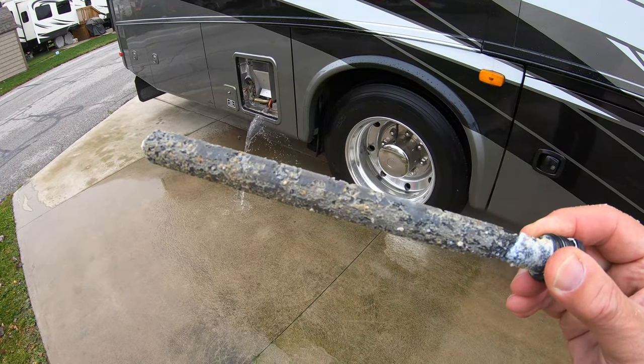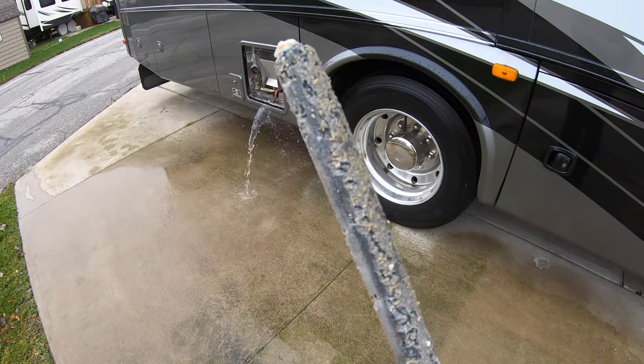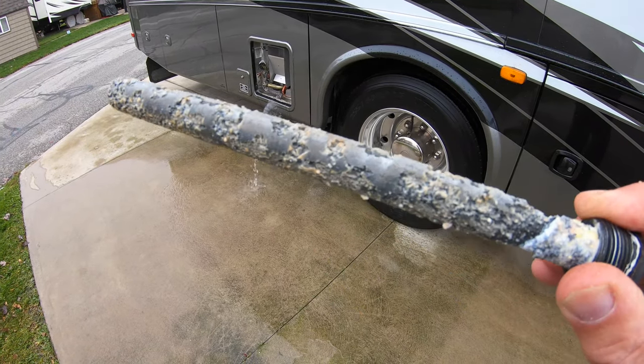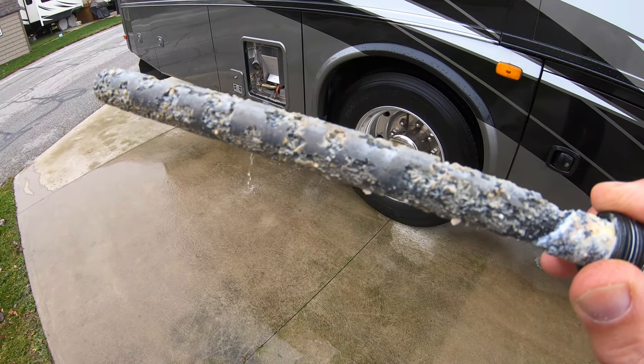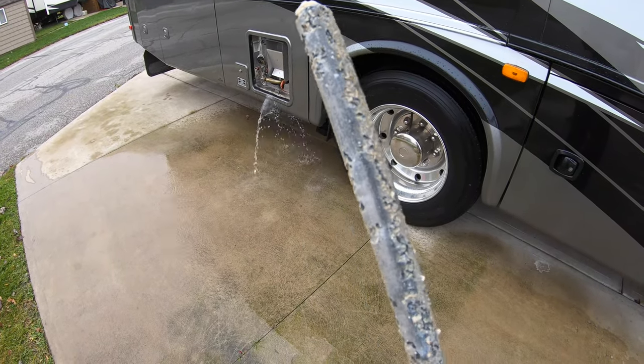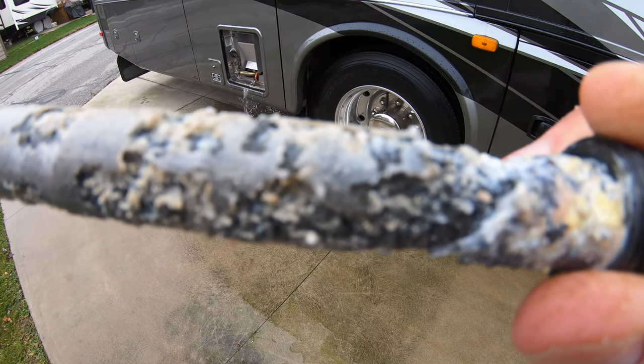So this is the condition of the rod that I've just pulled out, and you can see that I just replaced it about a month and a half ago. I've got a video on that when I rebuilt the whole tank, and I'll link it in the description. But that's with the rod, and this is magnesium. Magnesium sacrifices a lot more, and you can see right there it started sacrificing quite a bit.